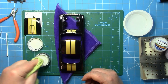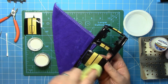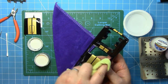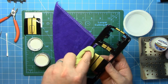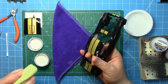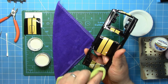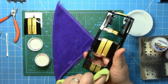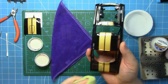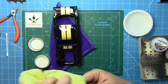Using a circular motion, then running backwards and forwards to work that compound into the surface and get rid of any imperfections left by the micro mesh. Once that's been worked in, buff it off. Then it's time to go into compound number two, which is the polish. I tried going at 90 degrees to the direction to improve the final finish, as I had noticed a couple of very fine scratches. I'm not sure it made a difference — while I'm quite happy with the finish, there are still one or two little scratch marks from the micro mesh.